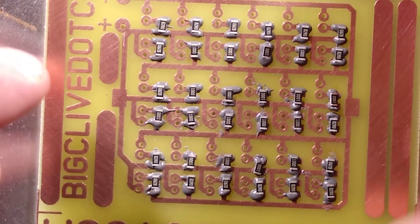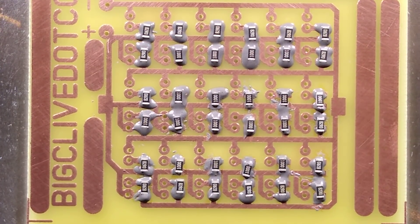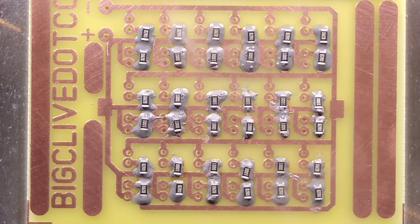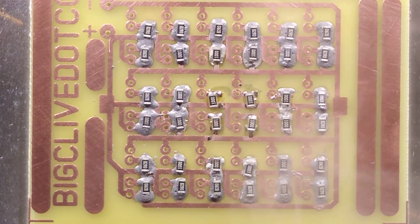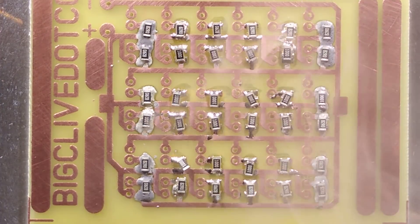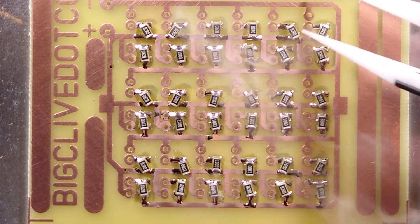Solder paste take two. I have used solder paste this time on this socket board, so I'm going to see how this works. The solder paste was much harder to apply than I was expecting, so this is heating up now. I've set it for 280 degrees Celsius. I can see stuff happening already. I can see quite a sudden transition here. Lots of vapour coming off. I can see the solder melting and the components randomly sliding all over the place, not necessarily where I want them to slide. It's quite fuming, but that is actually not looking too bad.